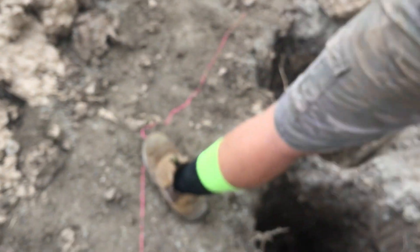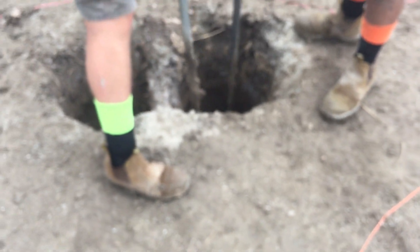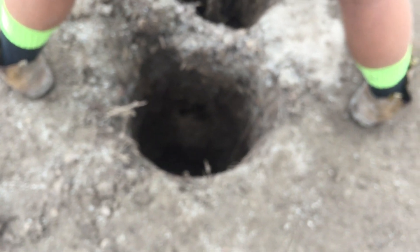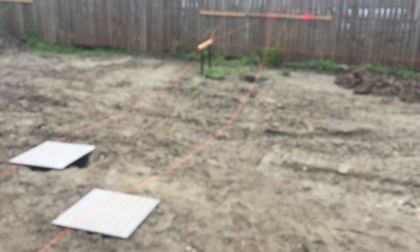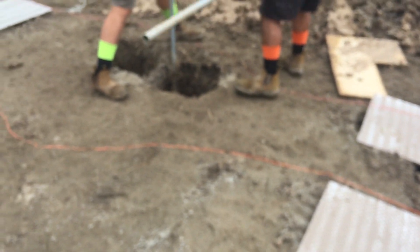It's sticky. They're doing a good job cleaning it out. The holes have got to be clean — all the loose mud and dirt has to come out from the bottom. There's nothing worse than having wet mud under a post; once they start building on top, the hole lets the stump sink because there's nothing but mud underneath it.